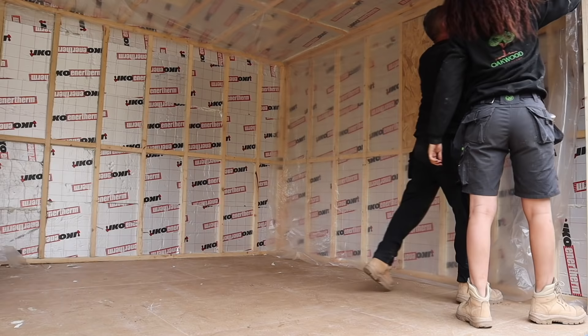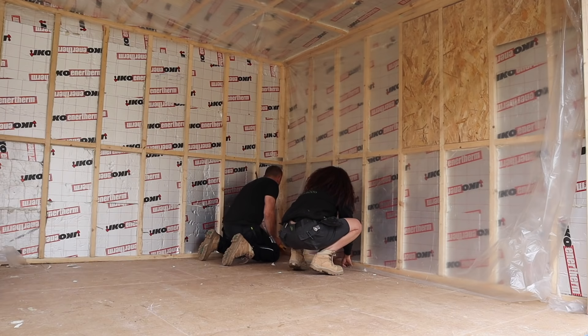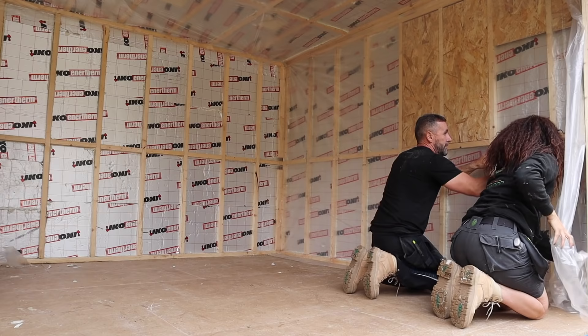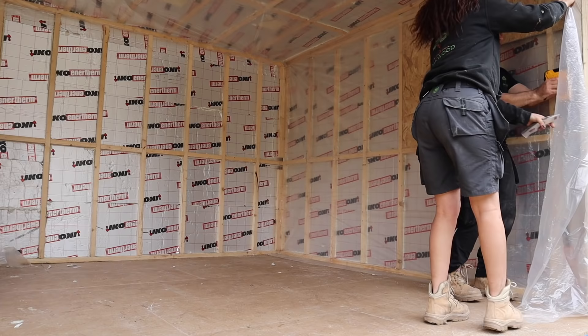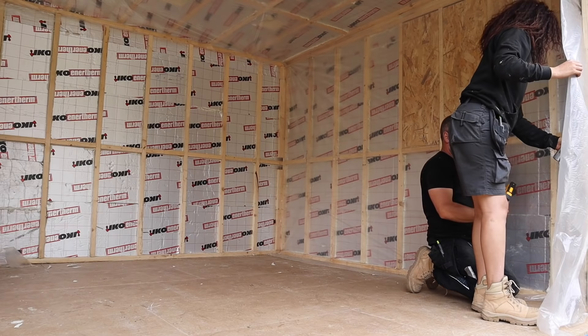For the wall, because it will want to pull off under its own weight, we're just doubling it up at the top to hold it better with the staple — it won't affect the plasterboard, we're talking microns rather than millimetres. Jen is pulling it down — if it's not perfectly tight it's not the end of the world, you're still creating that vapour barrier. These DeWalt staplers are spot on — about 35 quid. You've got to look at the time saving; if you're only building one of these in your lifetime, get the right tools.